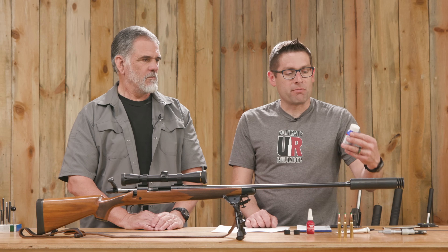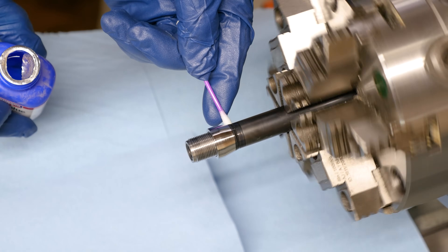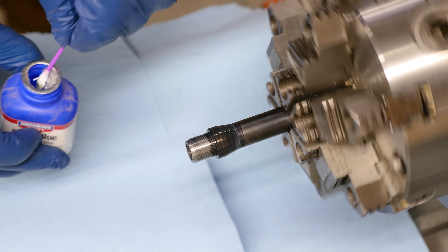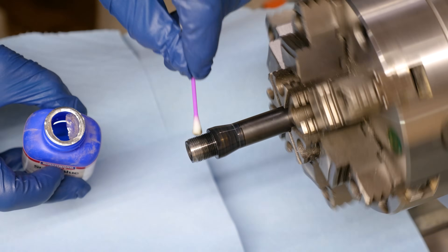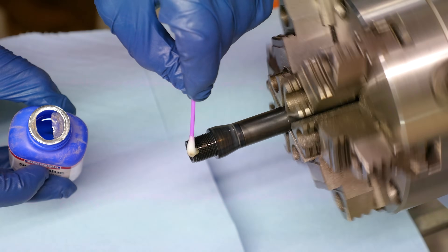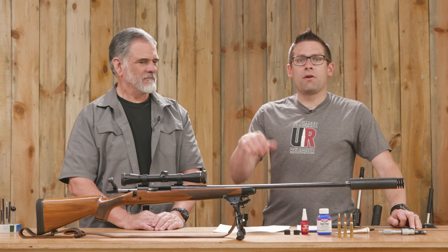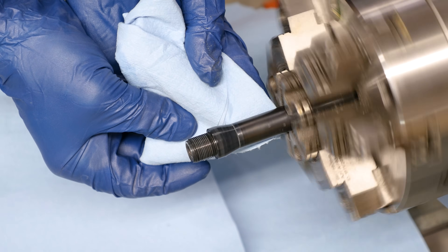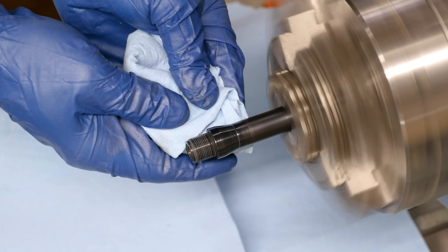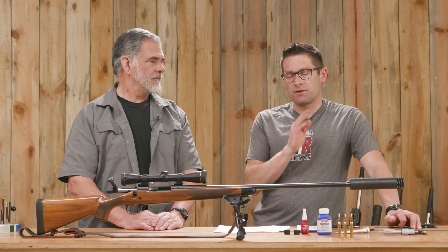We're using cold bluing — Super Blue from Birchwood Casey. I used a Q-tip with the lathe running at a couple of different spindle speeds. You want to protect your ways because it'll blue them if any drops get down there — use paper, not cloth, when you're in a lathe. Just ran the Q-tip on there. Got the threads real good — that'll help with corrosion, not that you'll have corrosion because you're going to keep them greased. Then we increased the speed, put a little bit of Viper's Venom oil on a blue shop towel, and ran that over there at high speed to polish it out and get it uniform. We also profiled the shoulder with a cut before the bluing to get it perfectly perpendicular.